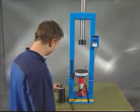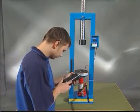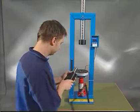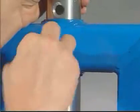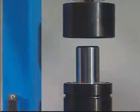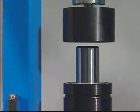We first check the spring size in order to determine what the initial force should be. Position the gas spring in the test rig and adjust the stop so that the stop is as close to the piston rod as possible without touching the piston rod.